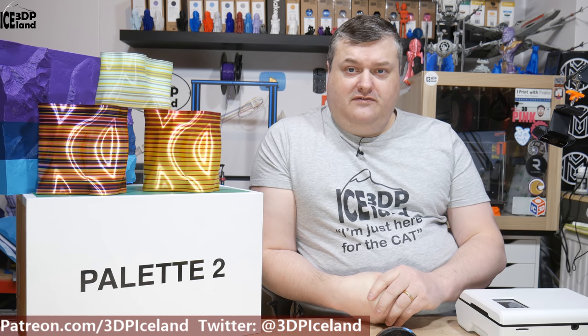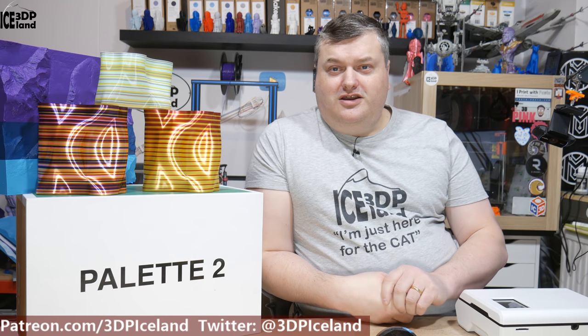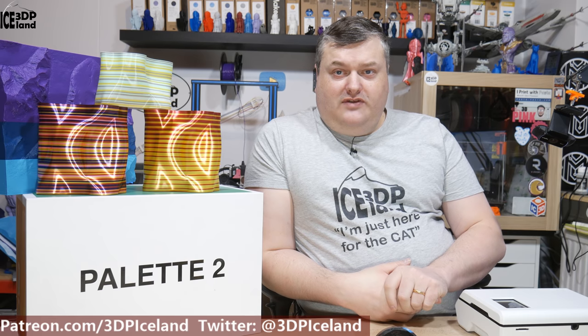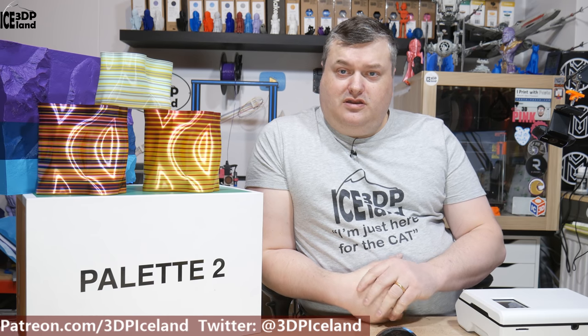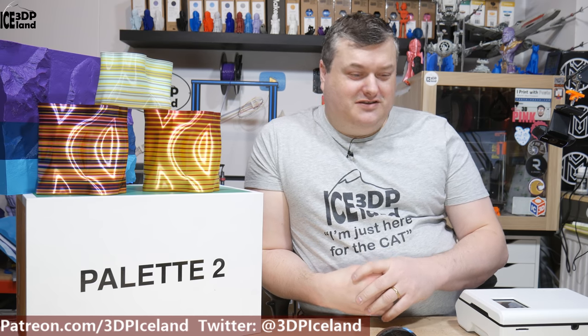I had this happen a few times. In those cases the filament was going around 1.82 millimeters. So if the filament you're using is out of spec it's going to get stuck. They have tested out several types of filament like PLA, PETG, ABS, and Flexibles, so you can use different types, but I would highly recommend that you don't cheap out on the filament and get good-tolerance filament when using this device.